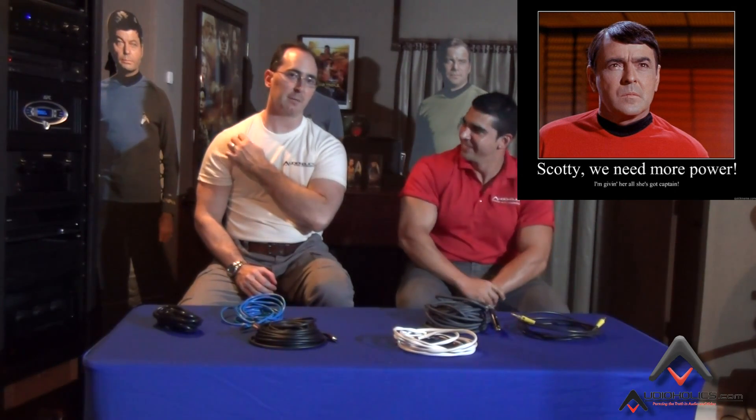At the very minimum, run at least two, maybe three dedicated 20-amp lines at 120 volts, and do at least one at 220 volts. It can't hurt — the only thing that's going to hurt is your wallet, maybe an extra couple hundred bucks. Also, wherever you're putting the subwoofers, try to make those dedicated lines too. In our room, we didn't run a dedicated line for the sub, and it shares an outlet with some lighting — so when the subs are really pounding and the lights are on, you can actually see the lights dimming.